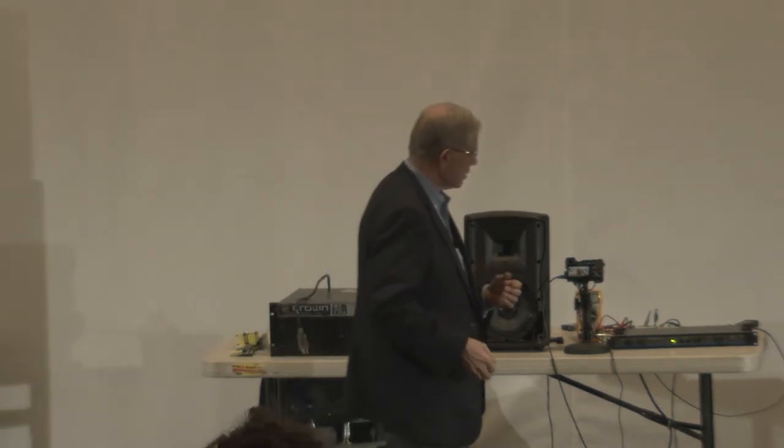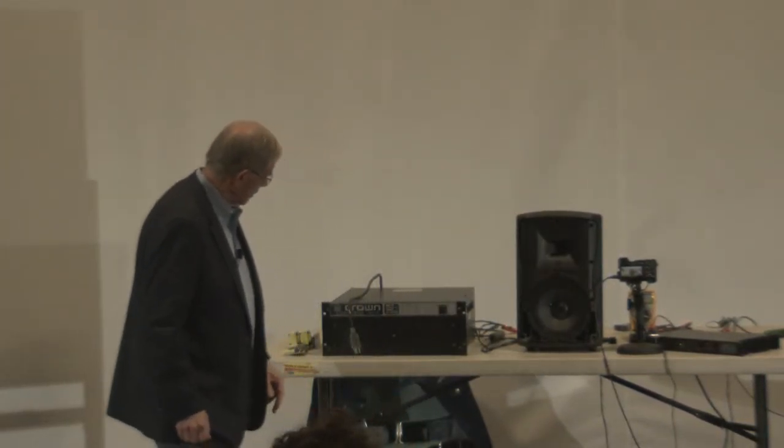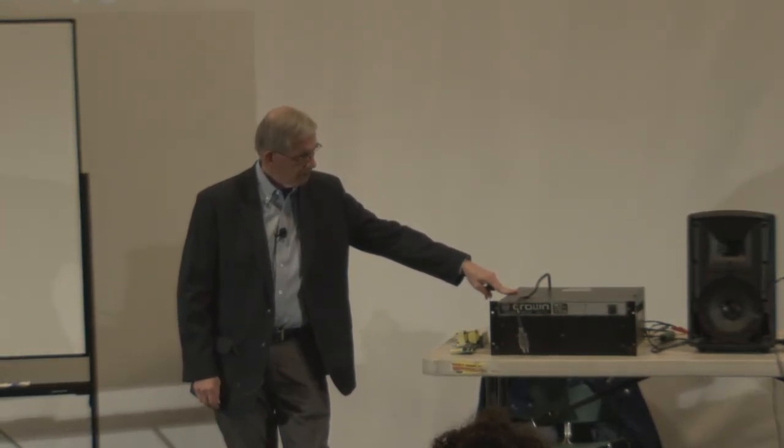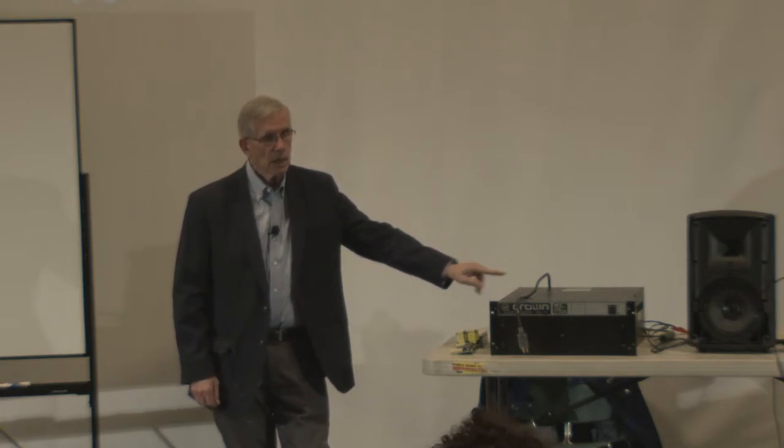To feed very low impedance, every time you double the number of outputs, you halve the impedance. And by outputs, I mean the output devices. This amplifier here, per channel, only has 2 output transistors. This one, per channel, I would say would have maybe 8 per side in order to get that, so it'll drive a lower impedance.